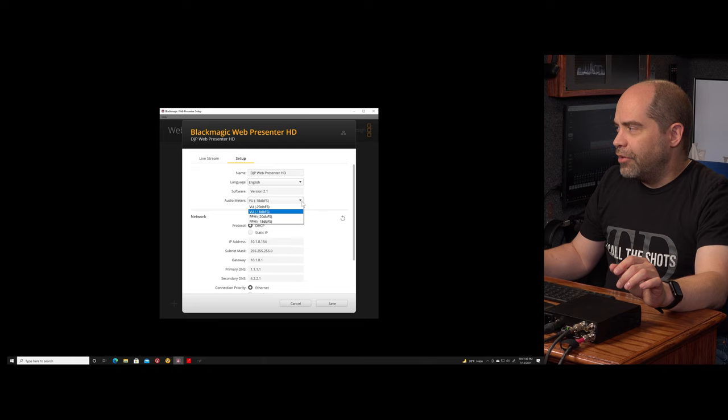There is no time of day information in this audio feed, but if there was it would be displayed here. Now for the audio bits — this is very similar to the luminance and chroma bits above. SDI audio is 24 bits, so we see a total of 24 letters indicating each of those bits. If we had a signal maxing out levels, we'd expect to see X's all the way to the left. In this case we're not utilizing the last four bits and often not even the fifth bit, which tells us we've got a lot of additional headroom not currently being used. If we had a 16-bit audio signal coming in on the 24-bit input, we would see the first 16 as L's or X's and the remaining ones as L's. In this case we are actually getting true 24-bit audio.